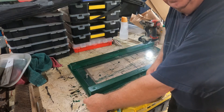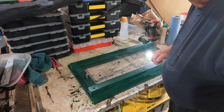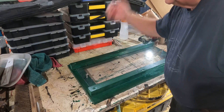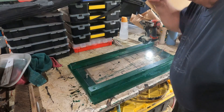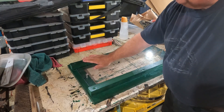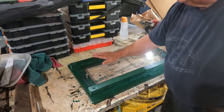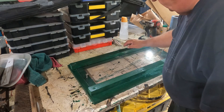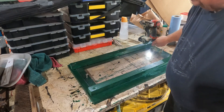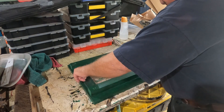I put a screw in the end and drove a big long screw through to hold it all together. Then this piece here is just an inch-and-a-half by inch-and-a-half cut from a strip left over from the ceiling joists I used for the garage doors. This could be three-quarter inch lumber too — way overkill — but I had it. I cut a little over a quarter-inch notch in the corner, and that's what gives it room for the plastic to slide.